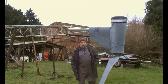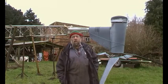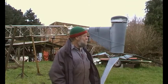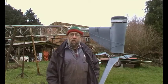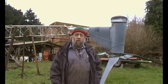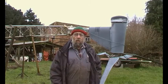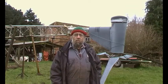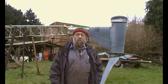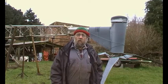In one of the recent videos I mentioned that the Proven turbine had developed a fault and that had wound it over. So here it is and we're just going to have a look at the various bits and pieces. Over the years this tower has had different generators on the top, and initially I had a hydraulic system for raising and lowering the whole tower. Since then the Proven is a lot heavier and that's caused problems, so I'm developing a gin pole system to work around the original pivot that I built on this.